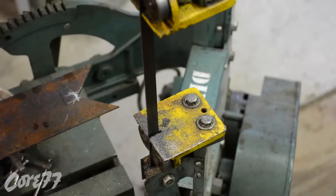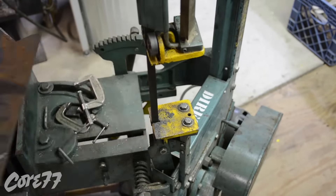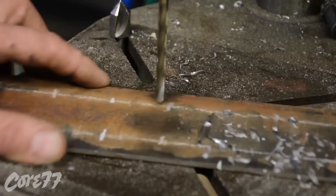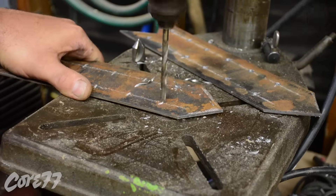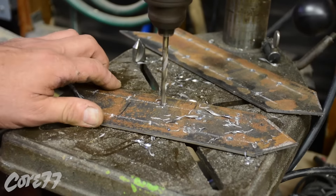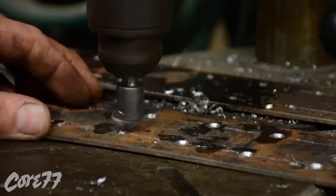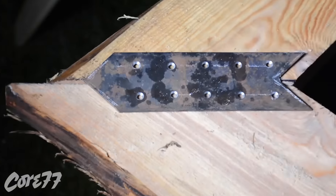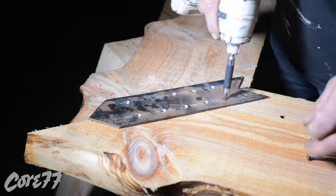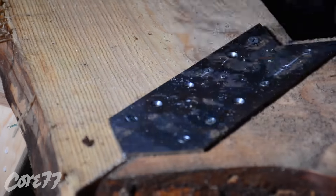I'm going to hold this frame together with steel brackets at each corner. I'm cutting and embedding these brackets — just putting them in temporarily to keep working on the back. I drill a bunch of holes in each one; each screw holds about 80 pounds technically, and if I put 10 screws in there I can count on a lot of holding strength. I bevel off the bars on one side and countersink the top. There's a bracket at each corner, and I'm also going to have some holding strength from the back once I put the chalkboards and backing panels in place.